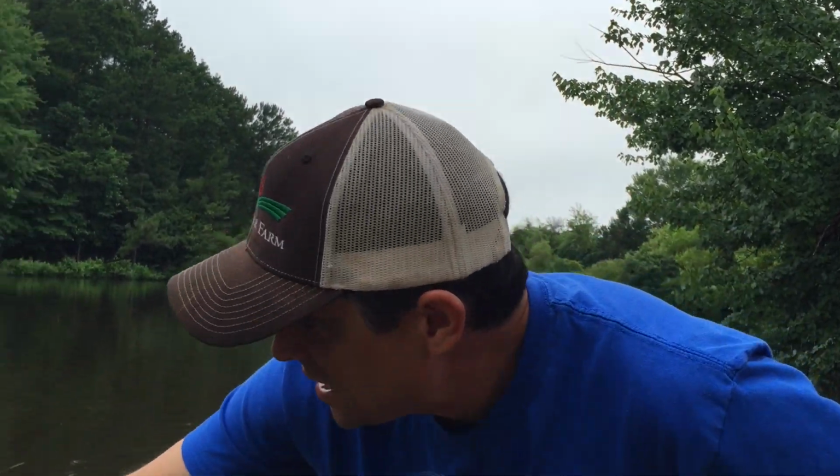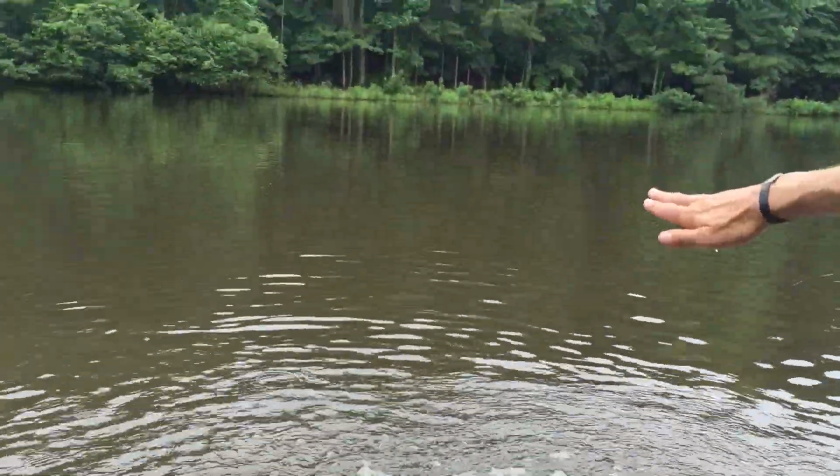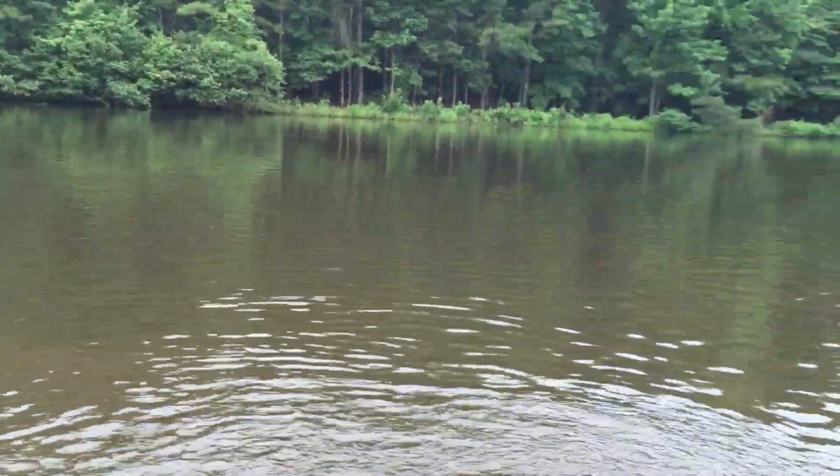And the way this works ideally is that when you've got something down at the bottom like this pushing water and air up, and it's creating a current going up to the top of the surface, as it comes up, you can see it's creating ripples in the water that will push all the way across the pond to the edge. And as it's pulling up from the bottom, you create a circulating current, a donut, 360 degrees of pushing water back around and aerating the whole pond.